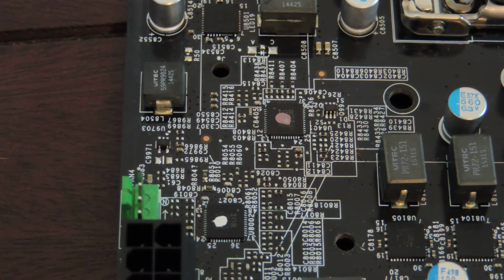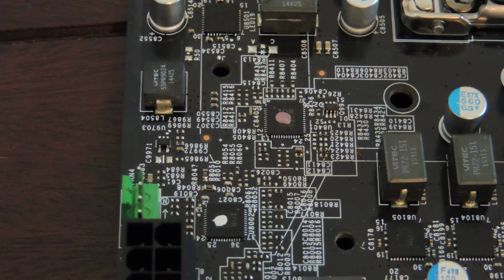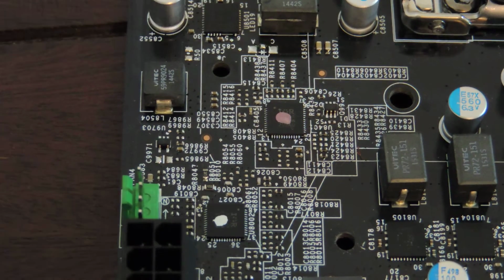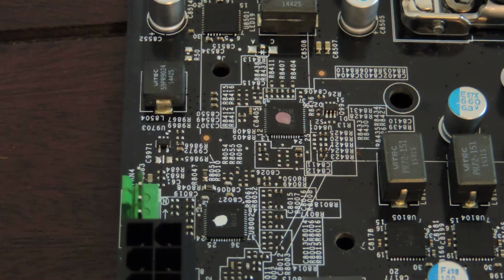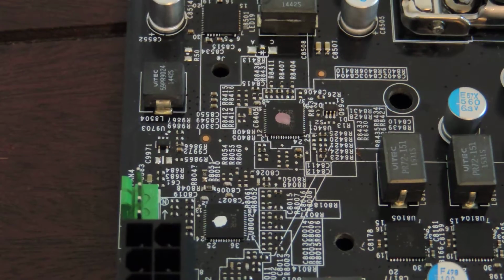This is a very popular PWM. I believe this is a 6-phase or maybe a 4+2. I don't know. IR has not released data sheets. All I know for sure is that the IR 35201 actually has 6+2 phases and has 14 pins on each side. This has 12 pins on each side and is an IR35203. Higher number does not mean a higher phase count. Many times it means less. In this case, I believe it's just a straight 6-phase. It doesn't have the extra +2.